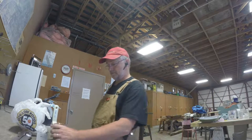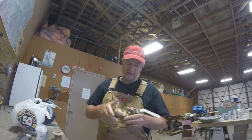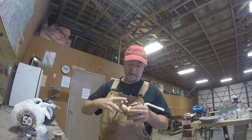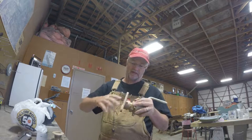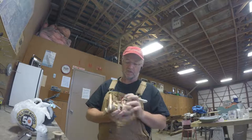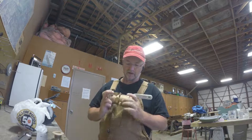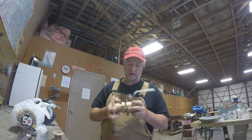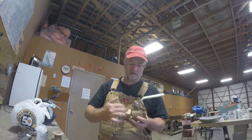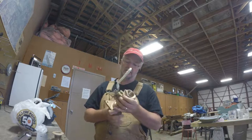In the last installment, I showed you my Groko seacocks and flanges. I was concerned that they didn't turn all the way in and seat properly, so I actually wrote to Groko and they responded. They said this is tapered pipe thread, and it's designed to turn in about three or four turns by hand and then get tight. I was concerned because it's brass — with a wrench this size you can apply an awful lot of torque. They said the fittings can take a lot. So they're not designed for the flange to seat up on the shoulder, which is kind of a puzzle to me, but that's just the way it is. I'll have to install them that way.